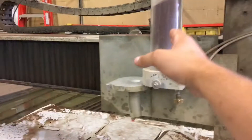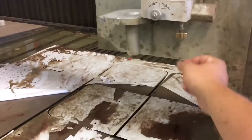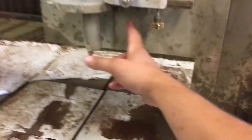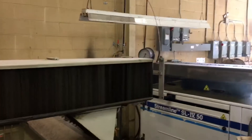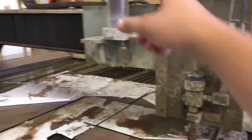So I'm narrowing down — I've got sand here, and there is some sand coming out there. Well then there's something in here, right? Because otherwise it could be that the pressure could have been dropping on the intensifier, or like I said, we could have ran out of sand.